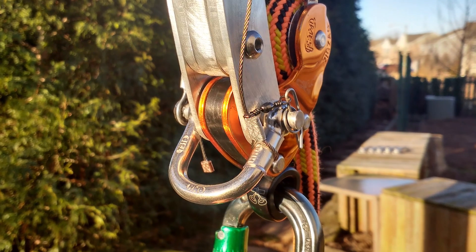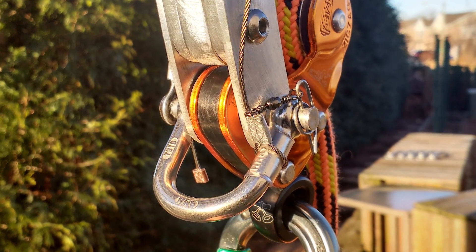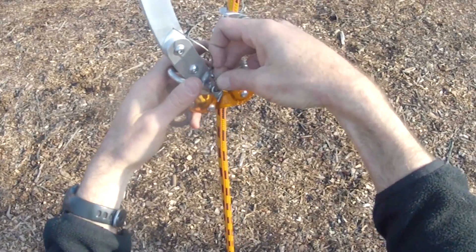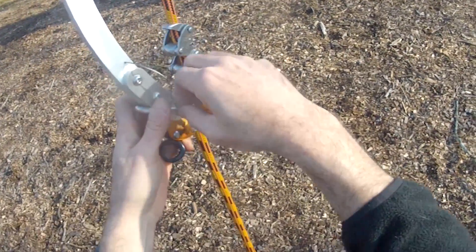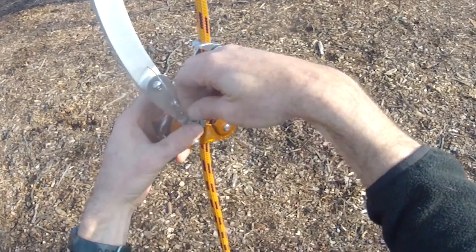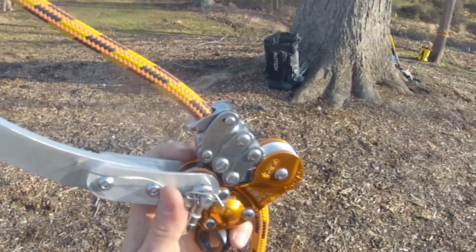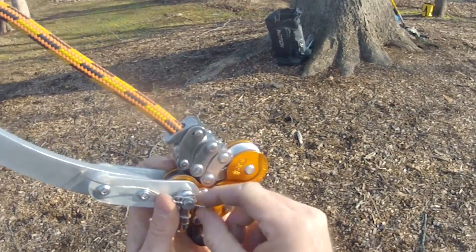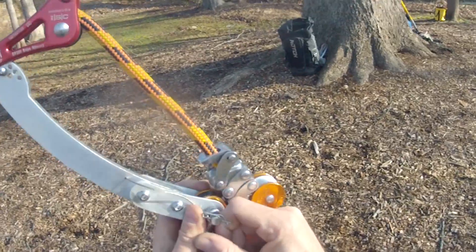Here's a close-up picture showing how the pieces are attached together and assembled to connect the tether and the zigzag. The round cotter pin has two configurations. It can simply slide into the hole in the end of the clevis pin, but in this configuration it's possible that a snag could pull it off. In the locked position, the round cotter pin is inverted so that one free end of the pin is behind the other, making it nearly impossible to pull the pin off without first unlocking it.